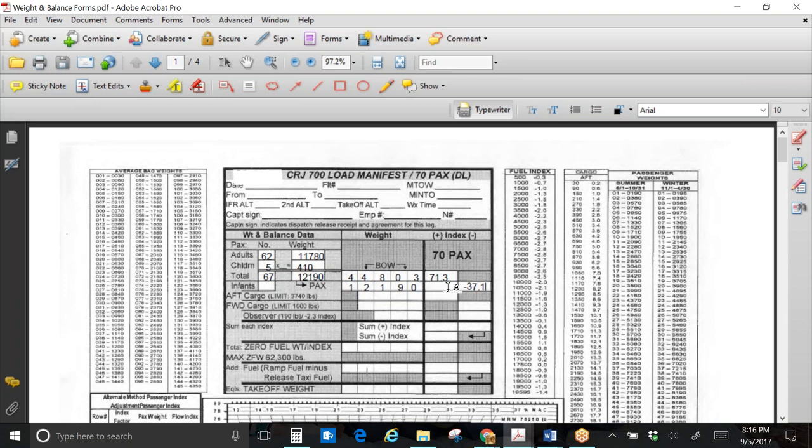Now, when you're looking at the cargo, that's where the bags obviously go. The only thing in addition to the bags that you're ever going to need to put in there is additional cargo. You may or may not have this on any given flight. It's just going to be random stuff. It might be pets. It might be mail. It might be a part for an airplane. It could be anything. But if they put random, non-baggage cargo on an airplane, then the rampers will give the pilot crew a little slip showing what the cargo is, how much it weighs, and whether it's in the aft or forward. They're responsible to give them that, as well as the total bag count.